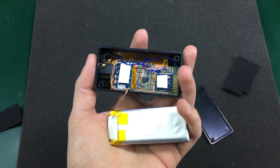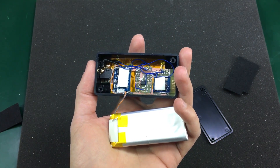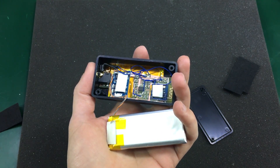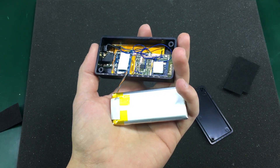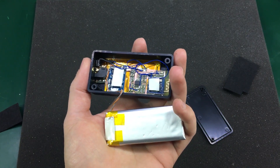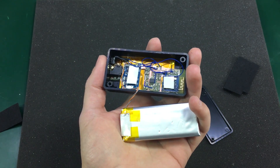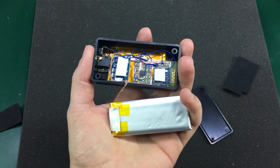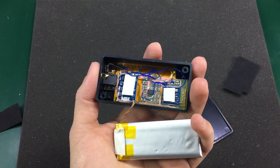I've tested the module and it works really nicely — it gives really good sound. There was one problem during testing: one of the channels was performing badly and had slightly lower output than the other. So I checked with the oscilloscope and went backwards along the signal path. I started from the output of the op-amp and noticed the signal was lower on one channel. I moved to the input — signal still lower. Then after the input filtering — still lower. So it had to be from the Bluetooth module itself, and it turned out to be a bad solder joint on the castellation vias of the Bluetooth module. After I fixed that, I got very nice and clear sound.